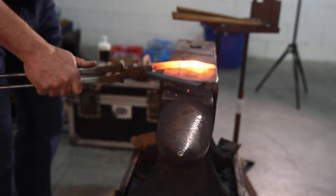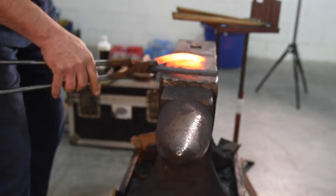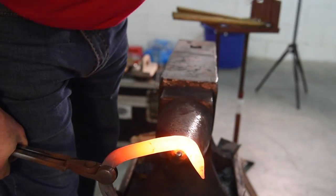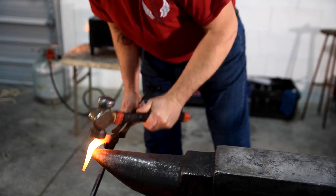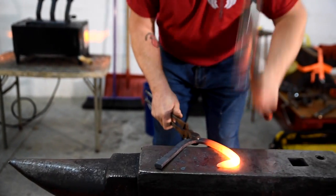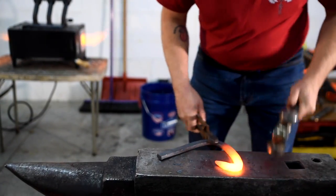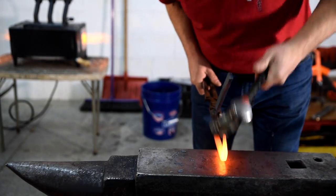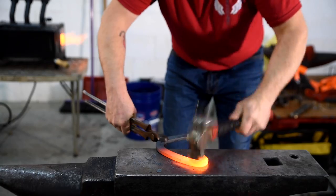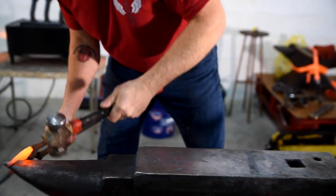So once we've prepped up the scarf and we're ready to turn the first branch, I usually mark the dot of where to turn the first part on the outside of the branch. So with it sitting up looking at you, you can use that as your guide to turn the end of the first part of the bar over towards the inside. It's important to keep the branch straight at the back from the heel. And then before you turn the branch, break its neck behind the heel to get some shape of the heel behind it.